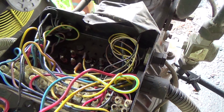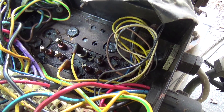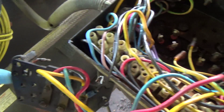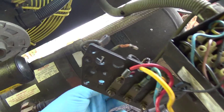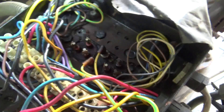We've got the wires off. One of them at least was burnt off of the star point — you can see the state of them. So that could have just come off and been touching the bottom here, which would trip the RCD out.